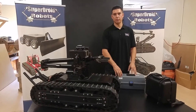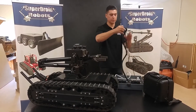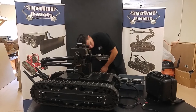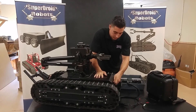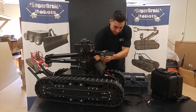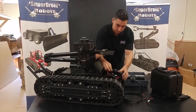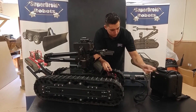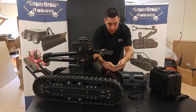When preparing for your next mission, you need to charge the robot. Open the case up and fully extend the cables. Begin by plugging the main charger into the wall. Now open up the robot by undoing the screws — they normally put them in the lid so they don't lose them. Undo the connectors on the batteries and keep these cables out of the way. Make sure all the colors match when you're plugging in the charger: white to white, green to green, red to red.